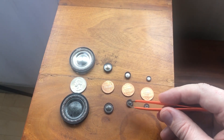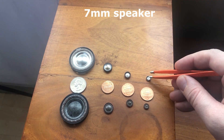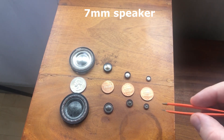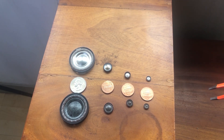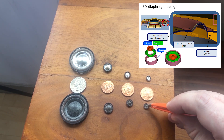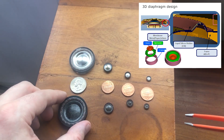Down to the 9.2 millimeter driver in both Nomex and aluminum dome versions, and then finally the 7 millimeter Nomex and aluminum domes — 7 millimeter is the smallest today. There is a physical limit of the molds for doing these surrounds down to 50 micrometers today, which is a very, very thin profile. Of course, it can be done in three dimensions — even down in the 7 millimeter, you might have 50 micrometers at the connection to the diaphragm, and as you see better with the 40, it can be contoured and adjusted in three dimensions to suit your acoustic requirements.